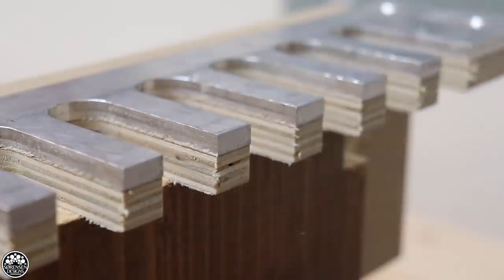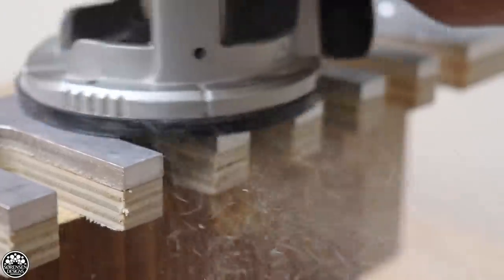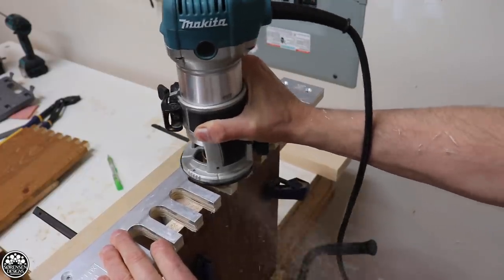I love using this spiral down cut bit for a variety of purposes — not least of which is doing box joints, as in my box joint video. I'll use a bit like this to hog out the material and get a much cleaner cut. I also have a longer version that came with my General Tools mortise and tenon jig. You use this on several passes — not unlike bits on CNC machines that go through gradually rather than taking big bites. I'm going to buy the half-inch variety of this in the future, but this is by far my favourite and most used bit in my workshop.